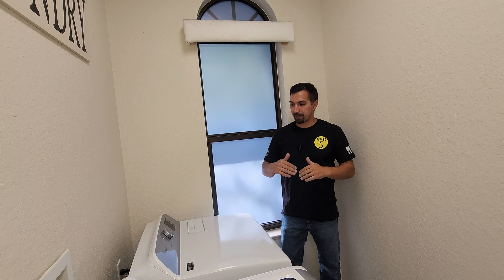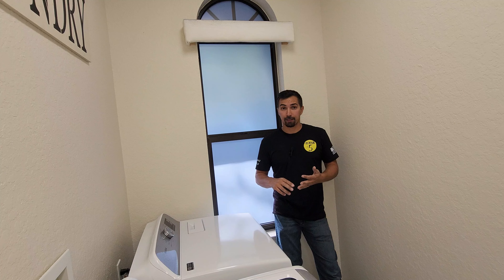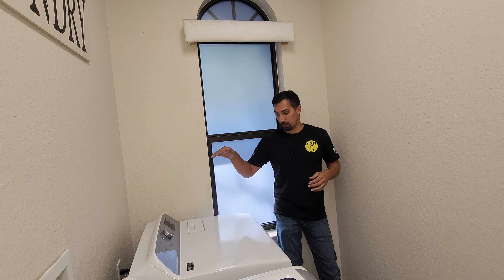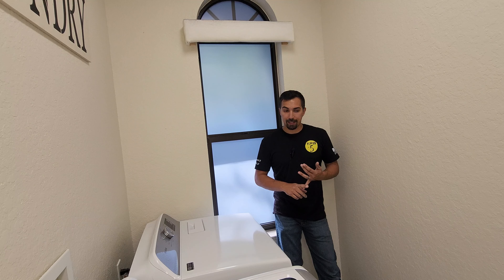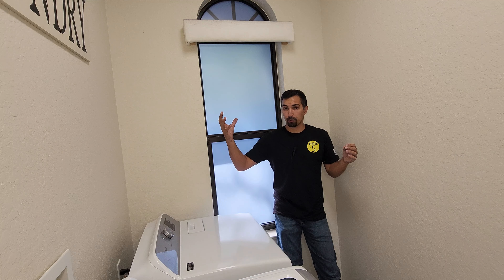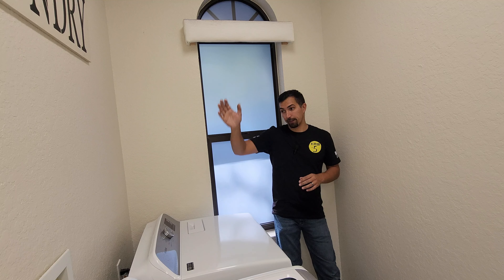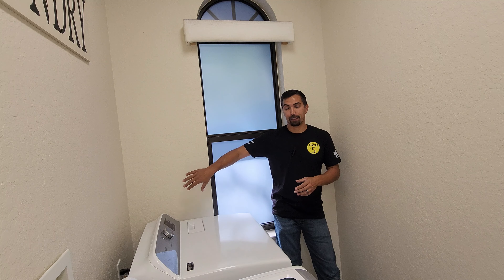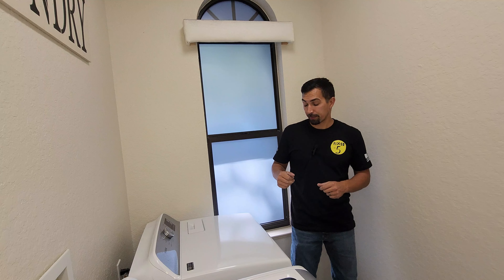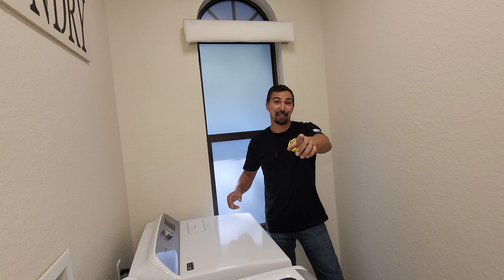That's it — all set, complete, and clean again. It wasn't hard to do at all. All you need is a shop vac, the attachment purchased off Amazon that lets you get into the lint trap area to grab debris, lint, dust, and dander stuck inside the dryer, and the long hose attachment with a bristle brush on the end that attaches to your drill — it was able to reach the entire tube up to the roof. Sometimes you only need one or two attachments if your dryer vents to an exterior wall close by. I really appreciate you guys watching. Hopefully it was entertaining. Stay handy, my friends!